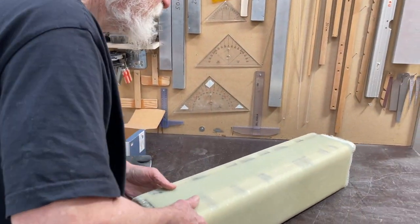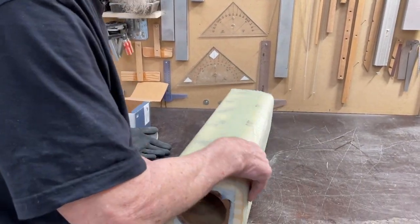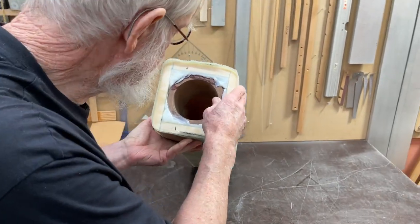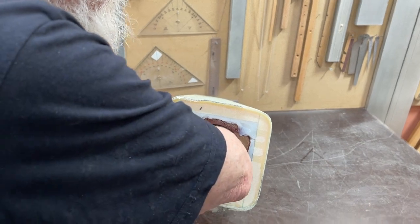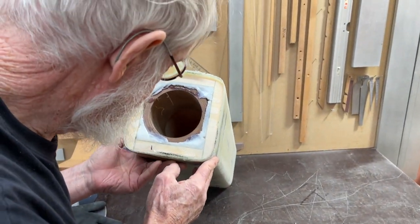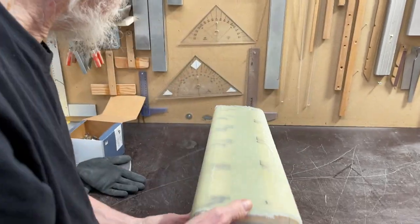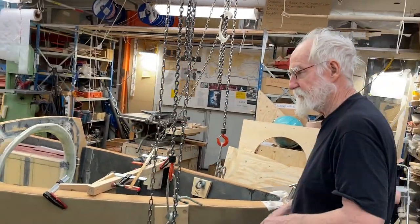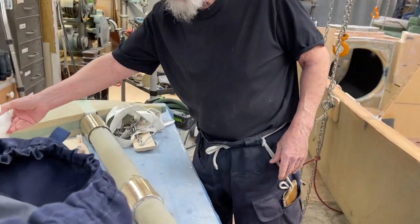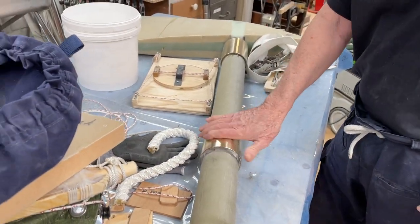This one is now laminated all around — it's very strong. The bearings are in, and it's laminate inside. Some people are worried it's gonna groove, get marine grooves inside here. But the bearings on the rudder are aluminum bronze, so nothing will groove here.